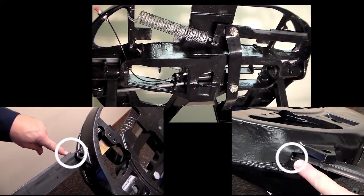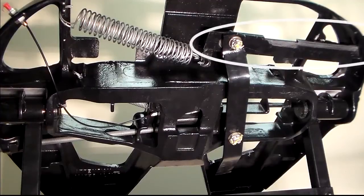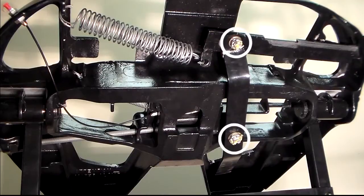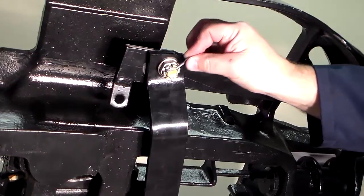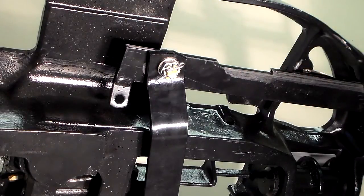Damage to the release handle notch or the release handle slot can be the result of two issues. If the release handle is bent, it may not properly release or knock off the casting during uncoupling, causing wear and damage. Over-tightened pivot nuts can also interfere with uncoupling, resulting in wear or damage to the release handle notch or release handle slot of the casting. Tighten the castellated pivot nut just enough to insert the cotter pin and secure the connection.